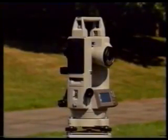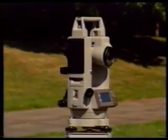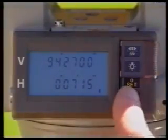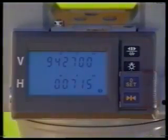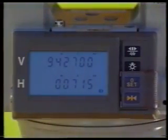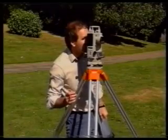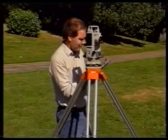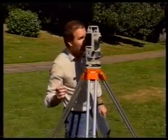The theodolite is now pointing exactly at the reference object on face left, with a horizontal circle somewhere between 0 and 1 degree. Lift the sliding cover and release the reading by pressing the hold release key. Then slide the cover back to prevent any accidental operation. Check the pointing, book the reading, and check your booking.